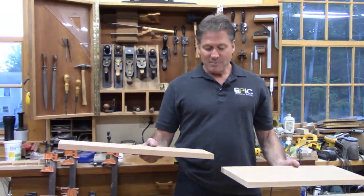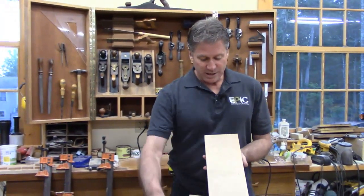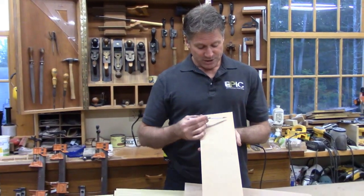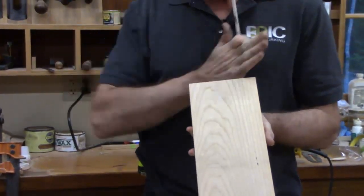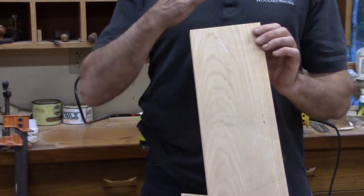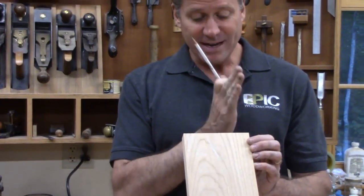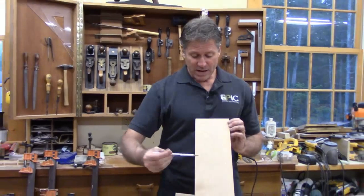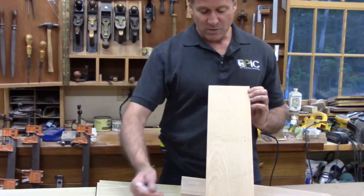So in making that joint, on any board, usually you have a choice. On the right, your right of this, you see this linear grain. That's where the growth rings are coming out onto the surface, and they create a line. If they're directly perpendicular to the surface, they call that quarter sawn, and you have a very linear plank. These are just starting to get there. In the middle here, you have these arcs. You can see that's very common. You've all seen that on wood.